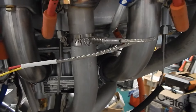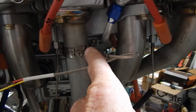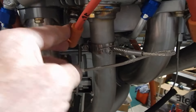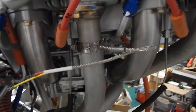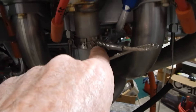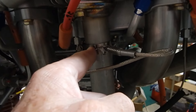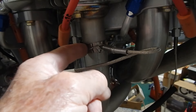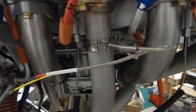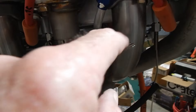I put this probe in coming out a little bit forward to give it the most room possible. If I'd come out the other way, I would have been close to the ignition wire — no point jamming things up in there. It's two and a quarter inches down, reamed to a number 30. This gets pulled in pretty tight, and then they say to safety wire-tie the flap to the sensor base and leave a loop.